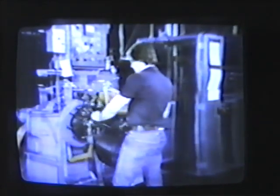Tire beads are also made by an extrusion process. Individual strands of brass-plated steel wire are gathered together as they pass through the extrusion die, which also surrounds them with an insulating coat of rubber and forms the assembly into a band. The continuous band of rubberized steel is wound on itself, forming strong, uniform, rubberized hoops, 4 to 6 layers thick.